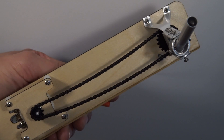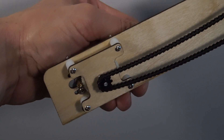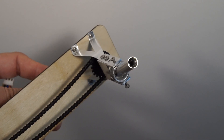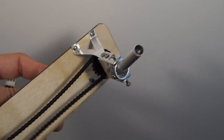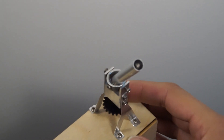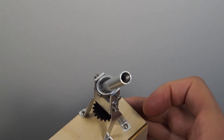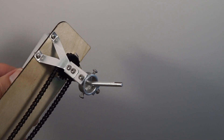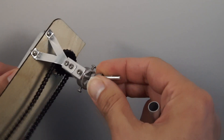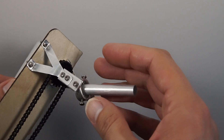This is a model I built to demonstrate the mechanism. There's a small motor — you don't need a lot of gear reduction here. Then you have the gimbal mechanism at the other end. When the plastic drive chain is removed, the mechanism spins freely with very little friction. Here the drive shaft has been exposed. There are some ball bearings that go on it, then the aluminum tubing fits on over that, which joins into the gimbal mechanism.